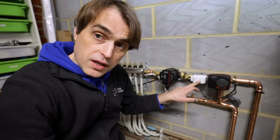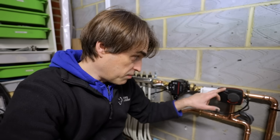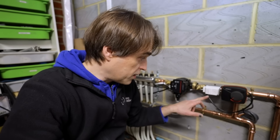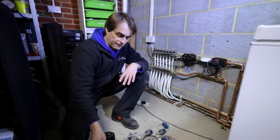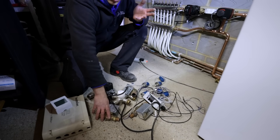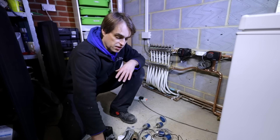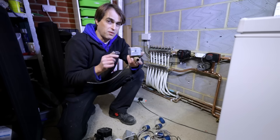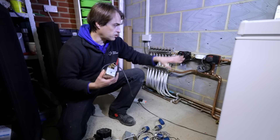In case it overheats, we've got a pipe stat that will shut the pump down if the flow temperature — the mix temperature behind the SB mixer — goes over the set temperature, which is now set to 45 degrees. We never want water hotter than 45 degrees entering underfloor heating. So this is what you're left with once you've finished converting traditional, inefficient, high-temperature systems — especially underfloor heating systems — into modern systems. Zone valves: no one needs those in the 21st century. This is all just pumped and mixed. Valves are removed — just a diverter for hot water.